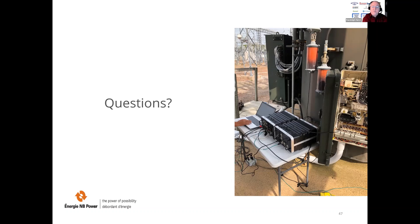Is there an application for this in motor vibration? Yes — I have done tests, about five years ago at James Bay with Hydro-Québec, associated with high-voltage breakers. There are motors used to push the pressure for air blast breakers, and we used the method to detect problems and abnormal impacts — and we found some. The idea is simple: use a reference from one that works correctly, do the same recording on one that does not work, then compare them. This way you are able to detect where the problem comes from.